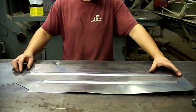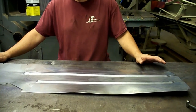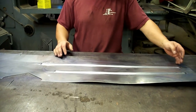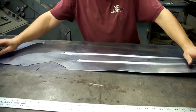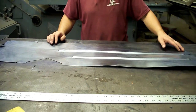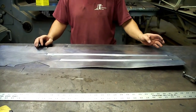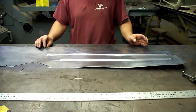We're going to run it through the flanger so it's going to get a little more tweaked and it will straighten it out. All these edges here and all the way around the corner are coming up right to this point. This edge from here to here is going to be turned down — we can do this one on the brake because it's straight. We're going to do this one on the flanger because we've got that curve in there. It's a tight radius so it's going to get a little distorted, but we'll go a little bit at a time and you'll see how that edge comes around. I'll meet you back over at the flanger.